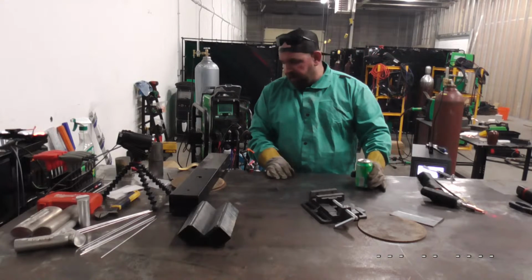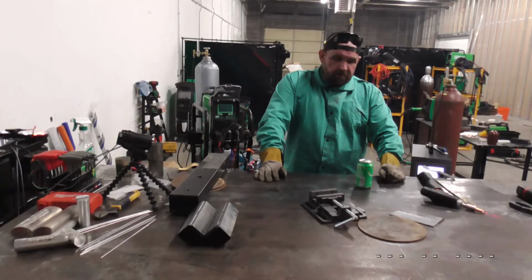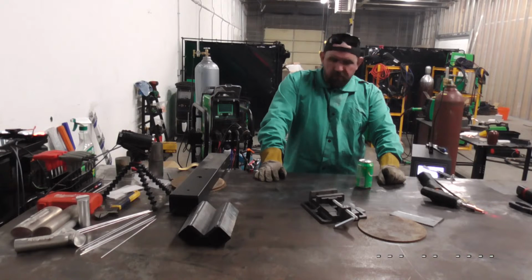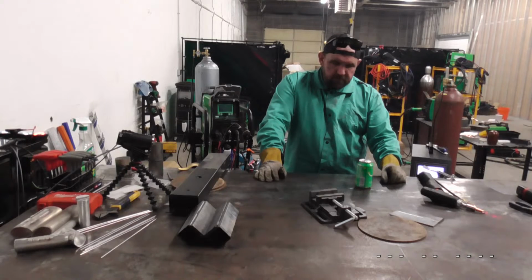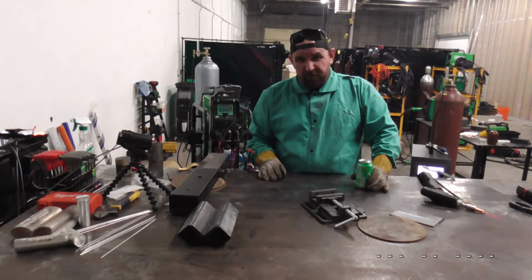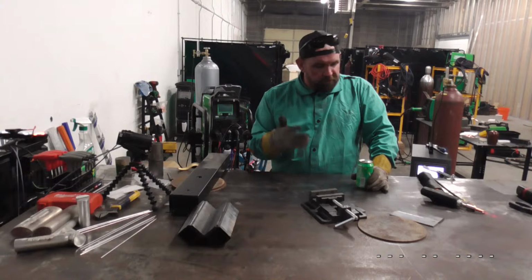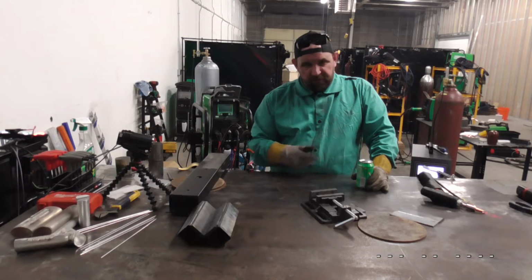There's almost no heat input in the material, which is a really nice thing, especially for stainless. I really think after playing with this thing, anybody that does thin gauge stainless, 18, 20 gauge, pharmaceutical, food grade, sanitary tubing, stuff like that, the lasers are coming real soon. I think that's really going to be the place where these things shine, for now, like this 1500 watt unit, only going up to about 1/8 inch. Thin gauge stainless is where this thing is going to kill it.